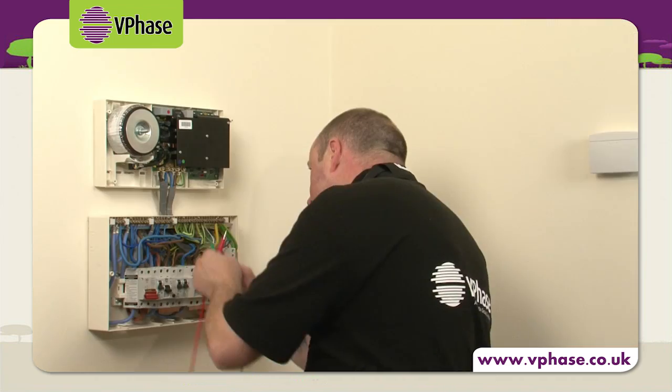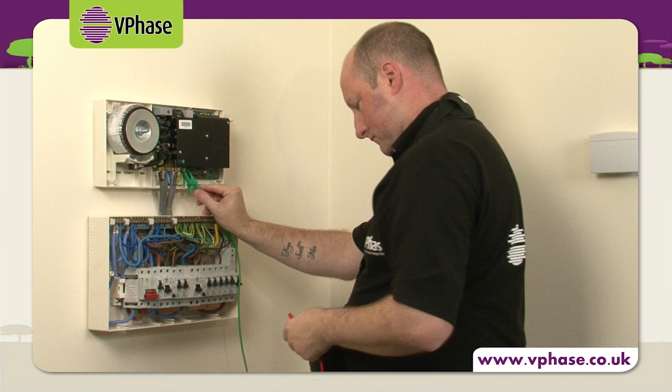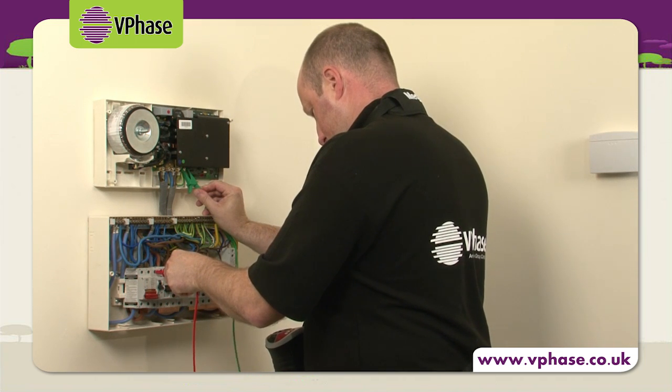Now that Andy's installed the unit and reconfigured the circuit breakers, it's essential to carry out step 6, which is the necessary dead test before the supply can be re-energised. The tests are only undertaken on what Andy has installed, and we'll start with continuity of protective conductors and polarity before moving on to insulation resistance tests.